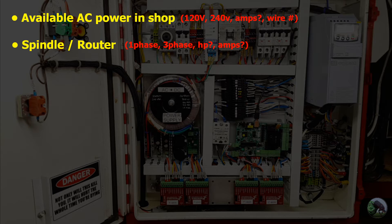You also need to watch out for VFDs. Some are not very efficient when converting single-phase to three-phase, and there'll be a power factor adjustment — some can be as much as 50%. So they'll give you a rating like, 'this VFD can put out 30 amps,' but if you're actually converting from single-phase, it's half that. Just be aware and careful about that, and realize that if you go VFD, you're going to need a little bit more current buffer.